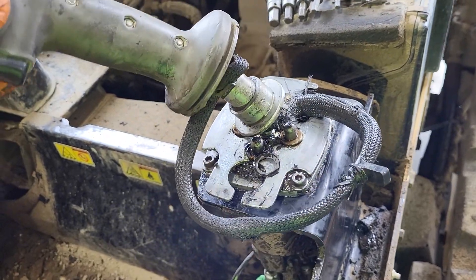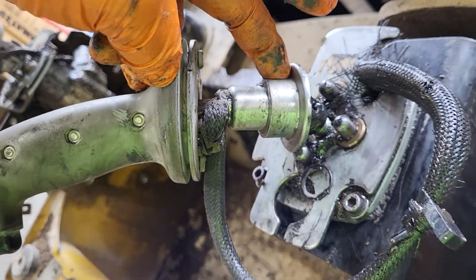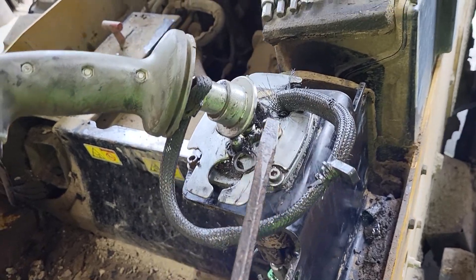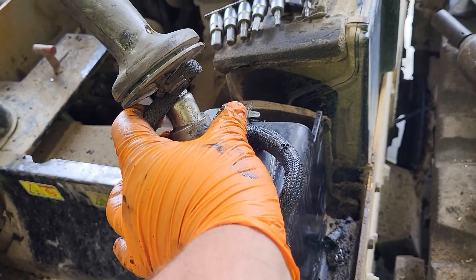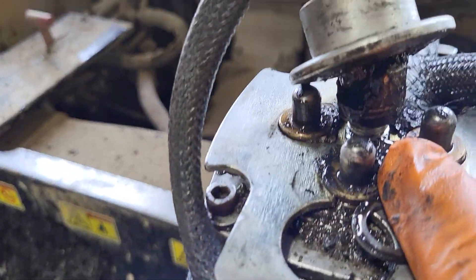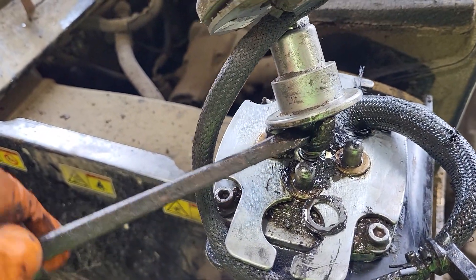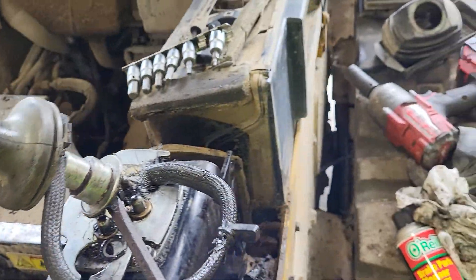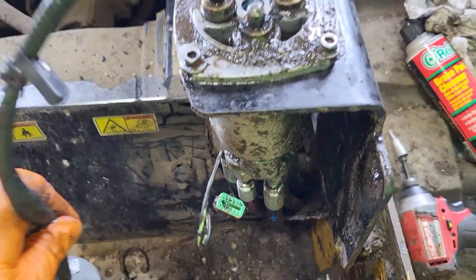There's no straightforward way to break this loose. This right here will take the actual handle off this universal joint. There are two ways: I've tried with a pipe wrench — you can put a pipe wrench right around here and try to break it loose at the bottom of the universal joint. Another way is to take a big hefty screwdriver, stick it into that universal joint, and actually twist it. There it comes.